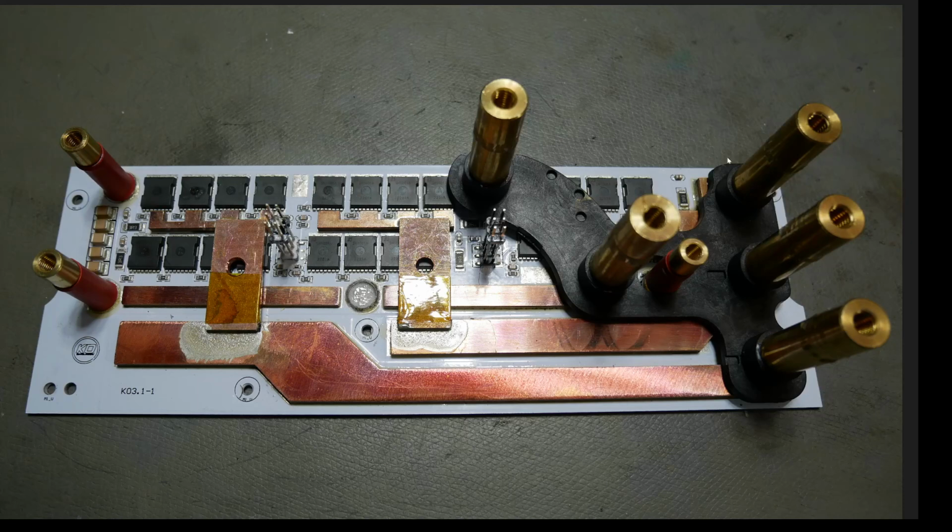Of course, battery plus is still not reinforced. This phase over here is still not reinforced. This piece of plastic is glass reinforced something. I don't know what kind of plastic it is. There's no molding mark saying it's polycarbonate or something like that, so I can't really say. It has to be a high temperature plastic because it has to tolerate these studs being soldered down. That's a lot of heat for plastic. So this has got to be some kind of high temperature plastic, whatever it is.